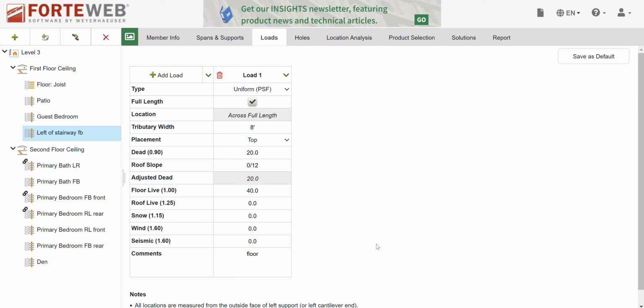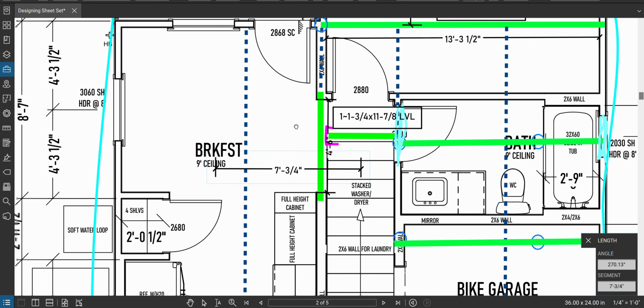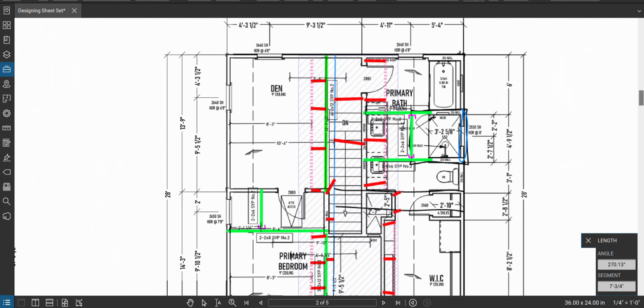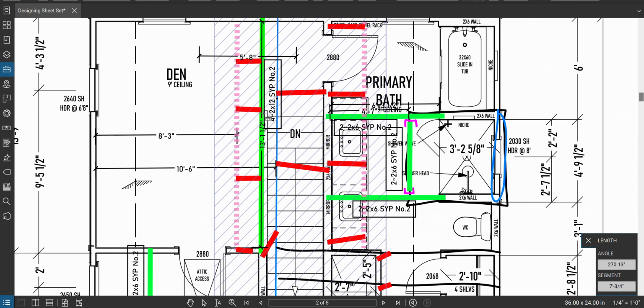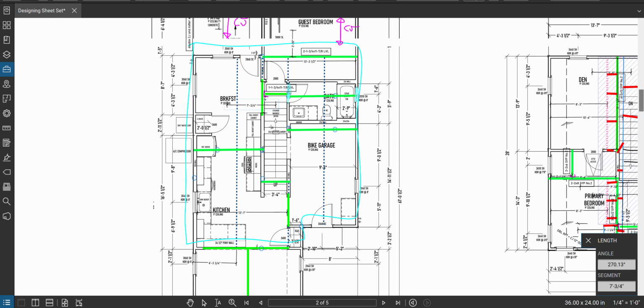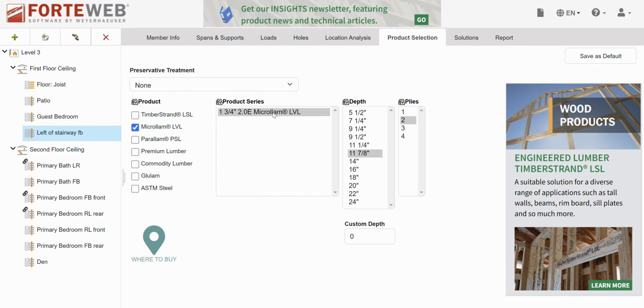So we're not done because we got to check something, right? So we're holding the floor here. But what else is above that? Right here, so this is a railing. It is not a load-bearing structure. So it's just a railing, right? So there's just floor and railing above this that's making the corner of this floor system. So there's no more weight. There's nothing else. The railing weighs something, but it's insignificant. So there's nothing else on top of this. So I'm actually good to go.